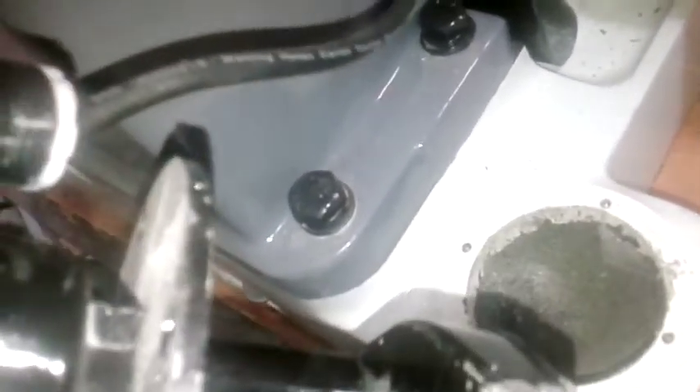Other things that need to be corrected: there are sharp casting burrs, and this cooling pump is all scratched. They tried to fit it using force because the hole is too small, and because of these sharp edges they just pushed it in using force.